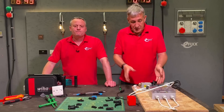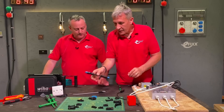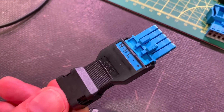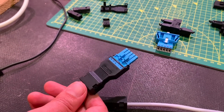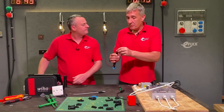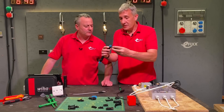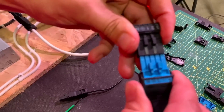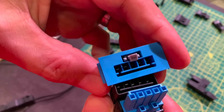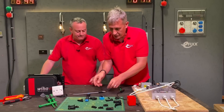The system has an immense number of variants. Here's a five-pole connector coloured blue — that's for DALI-based lighting control. We've had questions about DALI videos; if you'd like to see content specifically about DALI lighting control, drop a comment below. The great thing about this blue five-way connector is it won't mate with the ones from the standard series. Looking at the mating process, it's impossible to plug the DALI five-way in because it has a separate keyway — a little notch in the bar — that prevents incorrect mating.